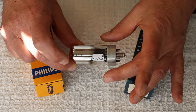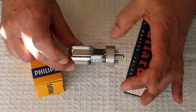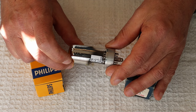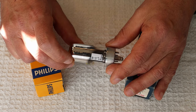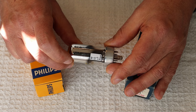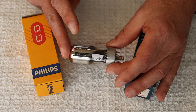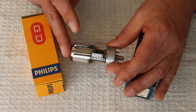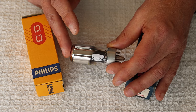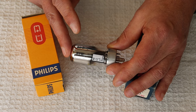So what we do is we rebase these — we remove the Loctal base and put a high-quality Octal base on. It's a proprietary method because it took us months and thousands of dollars in development work to figure out how to do it properly, and it takes a lot of time. In the end, you can buy a new old stock premium rebased Loctal tube as a 6SN7 for less money than a lower-grade new old stock, or about the same as the used equivalent in an Octal version.